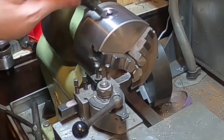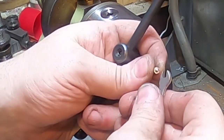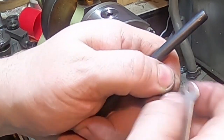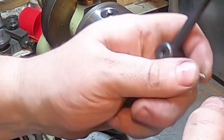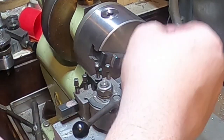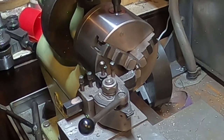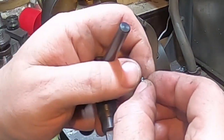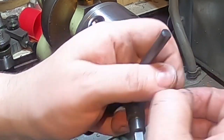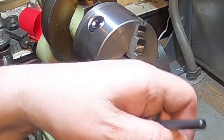We keep these captive with a nut in this head, the hex head the same size, they're easy to grip. A round corner on this makes them easy to start and makes it so that there's no burrs left on them and makes them fairly easy to get them all the same. So it's only a tiny little bolt. A set of lantern chucks would be really nice to do this, but that hasn't happened yet. And it's probably just as easy to do them in two operations. So set the nut to the right length, trim them all, and then come back and clean the ends of them up after you wind them in a bit.